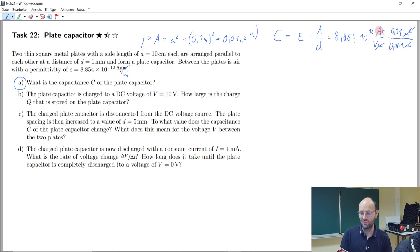The unit that is left is ampere seconds per volt, which we can rewrite as Farad. We just need to do some number crunching with the remaining numbers. The capacitance we get is something really small: 10 to the power of minus 12 is pico, and 0.001 divided by the denominator gives us 10, so we should get something like 88.54 picofarad.